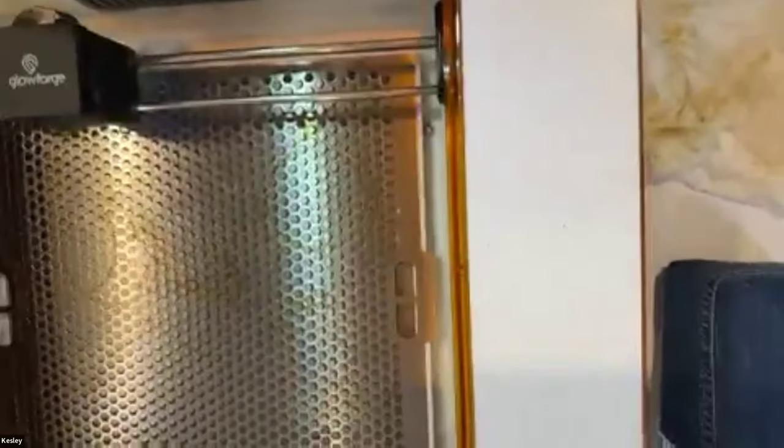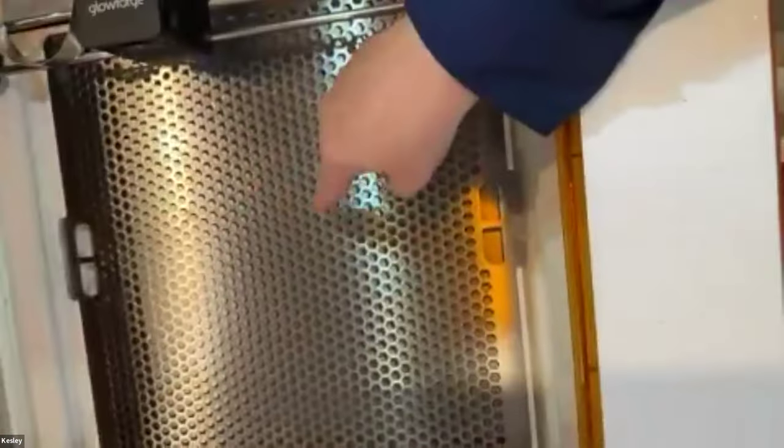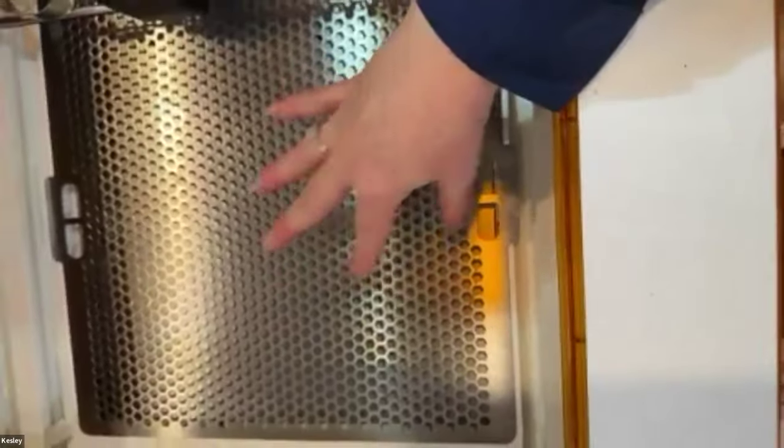I use the lint-free cloth because I don't want any lint left in the machine. These laser cutters are flammable, so I don't use this unsupervised — I would never turn this on and walk out of the room like I do with my Cricut or Silhouette machine. You want to get all that cleaned up. This grate picks up a lot — see how gunky that is? That's all from just that one cut. Your grate will pick up and then you can vacuum underneath there to get all of that cleaned out.